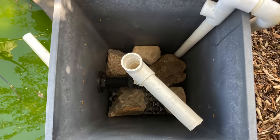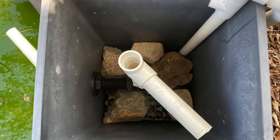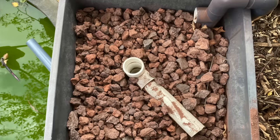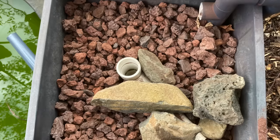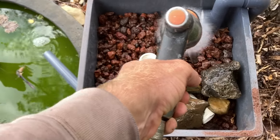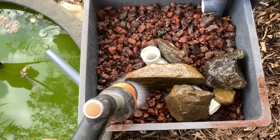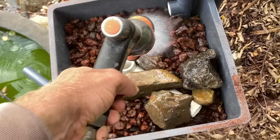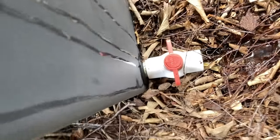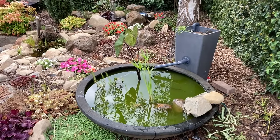Once the bulkhead was fixed and I'd run the filter for a few days to check for leaks, I could lay the rock. First some larger lemon-sized rock, then some 20mm river pebble, then finally some scoria. It doesn't really matter what type of rock you use — these are all just rock and pebble I had laying around in the yard. Then I rinsed everything off. The scoria is very dirty and we don't want all that nutrient in the pond. While rinsing, the clean-out valve is open, giving the birch tree a good watering. Once the water coming out of the filter is clean, I can shut the valve and fill it up with water.